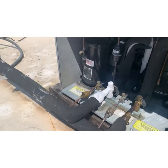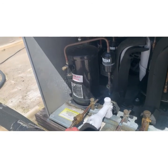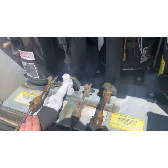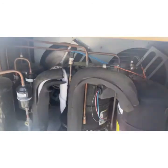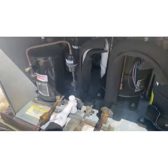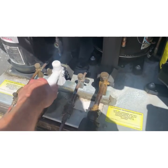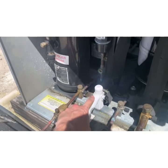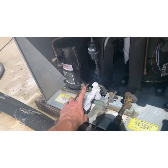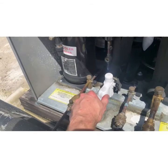This happening could be for a couple reasons. I'm not going to put gauges on it yet, but seeing that it's coming back, here's a good identifier way. You've got two compressors, you've got two sets of line sets. Which is the cooler and which is the freezer? Well, the suction lines, which are the larger ones, and the cool ones coming back, the larger suction line is always going to be for the freezer. You're running lower pressures, lower temperatures, so larger suction line. So you can see the size difference. So this is your cooler, this is your freezer.